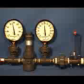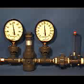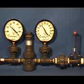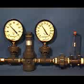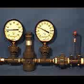In Exhibit 2, we have assembled a Plastomatic Series PR spring loaded pressure regulator using the identical parameters. As we initiate 4 GPM flow, we see the downstream pressure drop approximately 6 PSI. In fact, as we double the flow rate to 8 GPM, which is over 10 feet per second, we can see a pressure drop of approximately 14 PSI. In this demonstration you can clearly see that not all spring loaded pressure regulators are created equal.